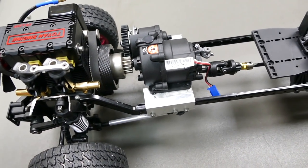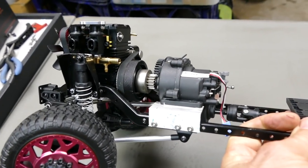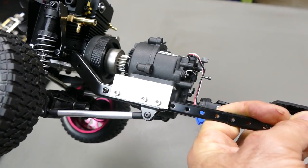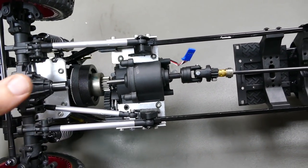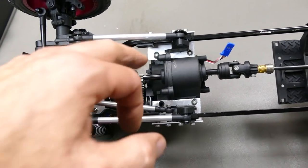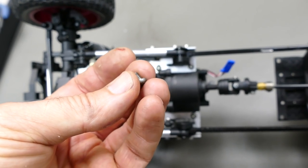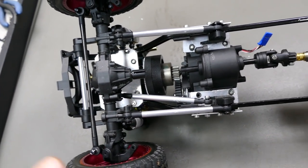Some really nice mesh here. Same process with the gearbox — you've normally got to hang them or attach them to the sides, but that's what I've done here. Pretty cool. This one is I think 1.5mm thick aluminium channel — it's obviously just an angle. A lot of measuring, and it takes a while. This wasn't my first set — I think this was my second attempt. These screws are actually old Meccano screws. A lot of the older guys will remember Meccano. They're the perfect diameter — I think they're M4. They're not too long and not too short, and they have just enough bite for these Revo gearboxes, and the thread screws into the bottom of the block.